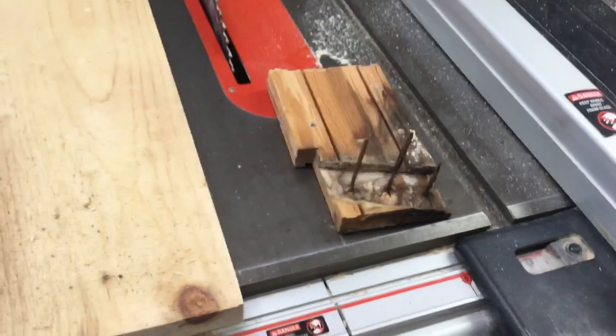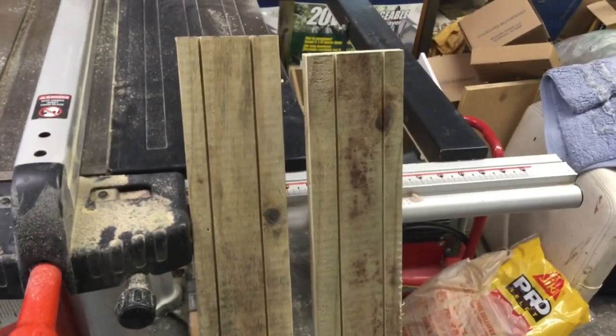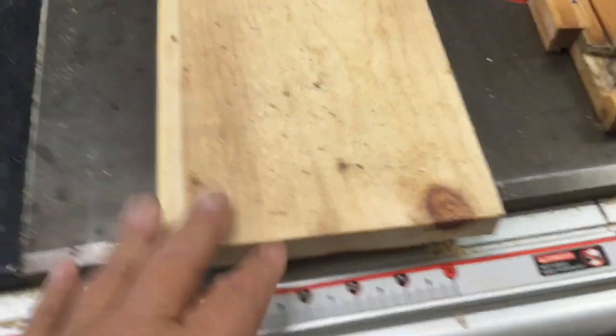So we'll go downstairs to the table saw. Hey, the next thing I'm going to demonstrate is how to make these side jamb pieces. I already made my own out of treated lumber. Actually, it's a treated 1x6, 3/4 inches wide. So I'll demonstrate using this piece of scrap. This is a piece of tongue and groove pine flooring. It's a little thicker than what I need, but it'll work for demonstration purposes.